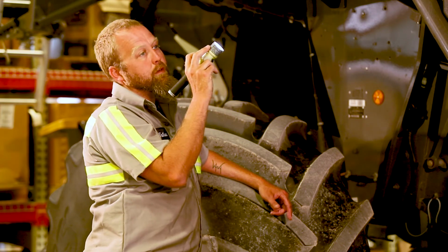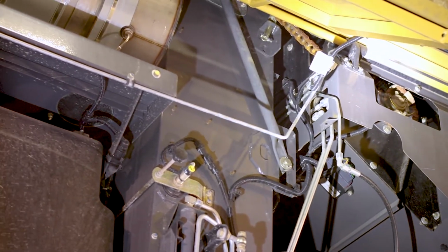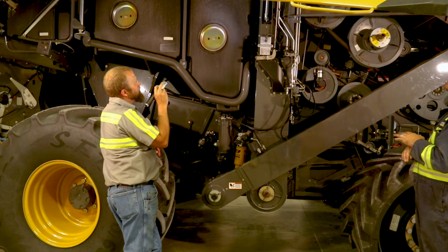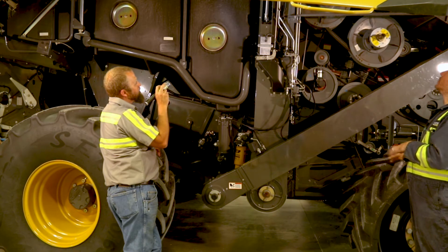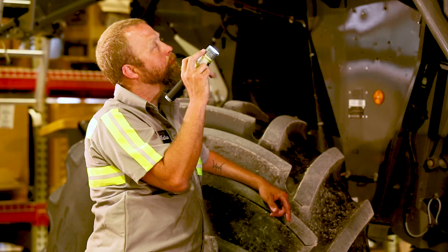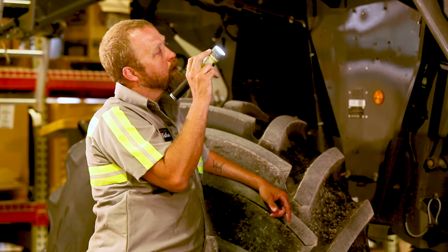It is also a chain that can be lubricated. It is not an O-ring chain. It's plain chain. So you can add some lubrication to it if it's a good-looking chain, but it's just a little rusty or a little stiff. It can be lubricated in a more traditional manner.